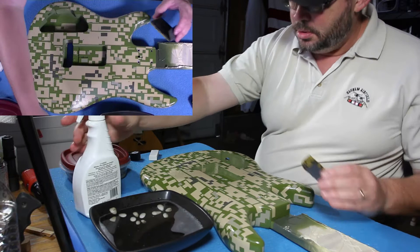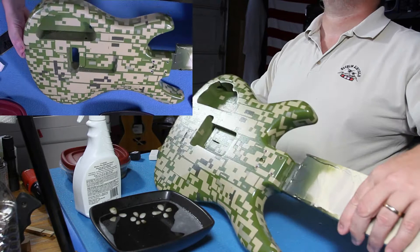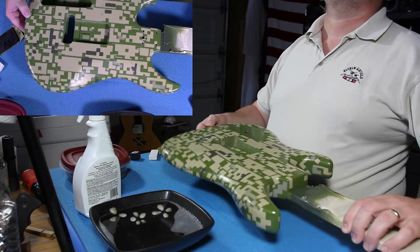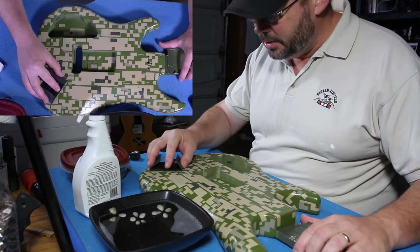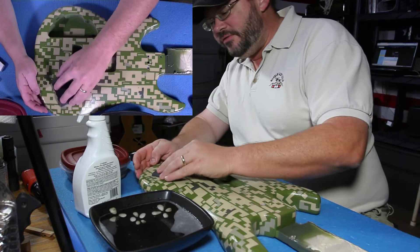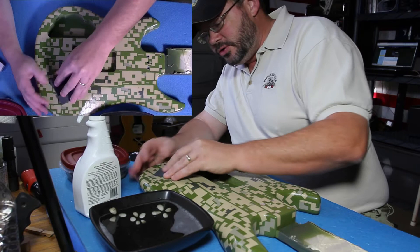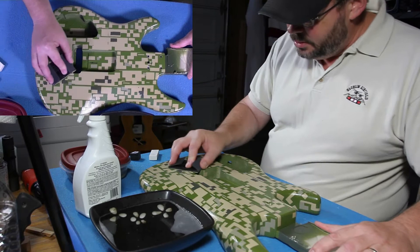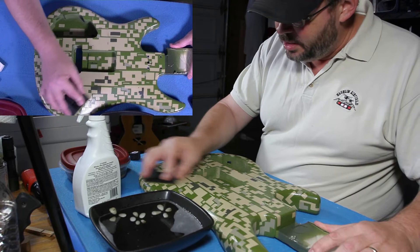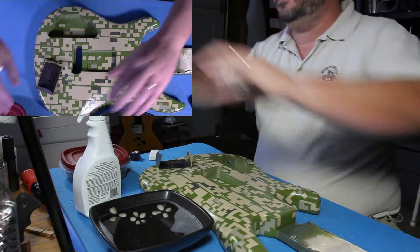You just kind of wet the surface. What you're looking to do — if I rotate this, you see that kind of shine on it, especially up there. That shine, I want to get rid of. I want it to be flat, because flat means it's going to be not reflective. So you're just trying to polish the shine off of it. The reason we use water is to carry away our sanding debris, and if any abrasive comes off the sandpaper, we're wiping that off too.